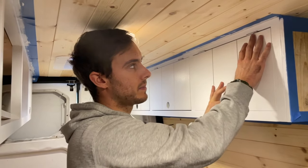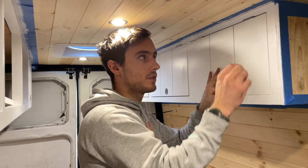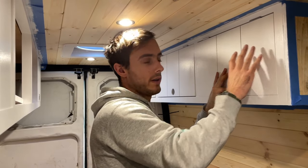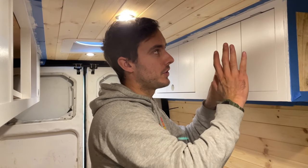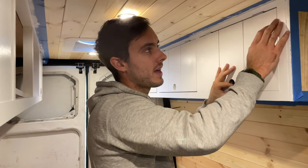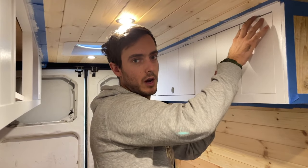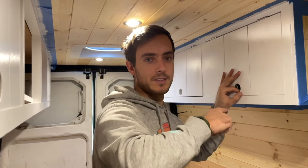Once we're happy with that we want to go up in that position. There are two ways you can do this: you can grab a spare hinge, remove the door but mark it first where they fall, get your holes drilled and then lift your door back in — or if you've got an extra pair of hands, my girlfriend's going to help me lift this in and secure it. I prefer that because if you don't have much tolerance on the edges and you get the mark slightly out, then you're going to have to re-drill your holes again.